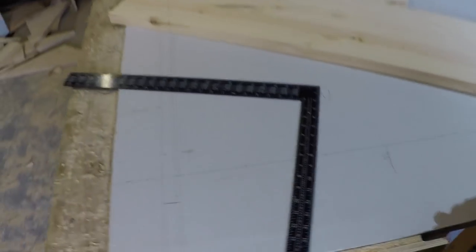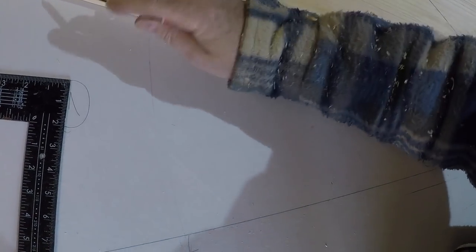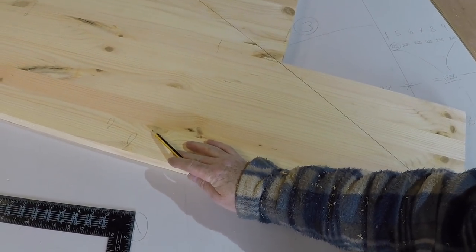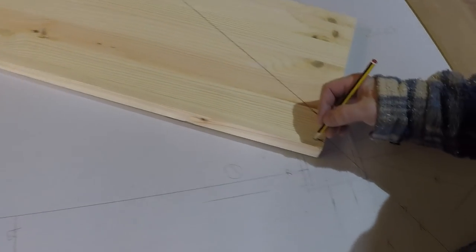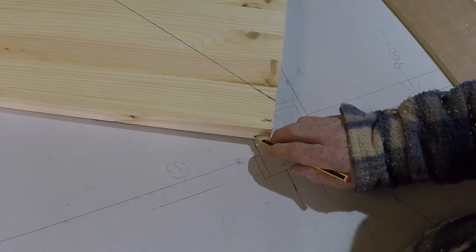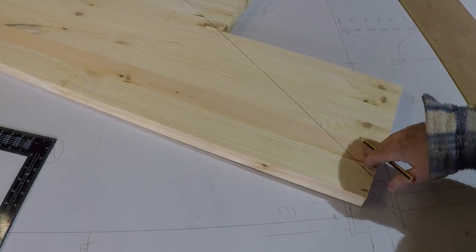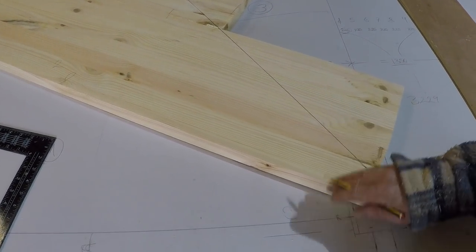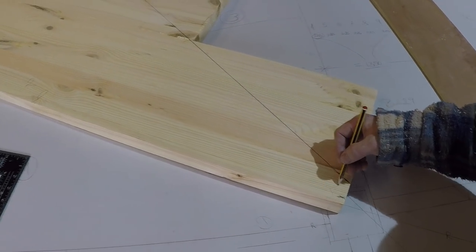There we go, there's our shape at number 2. That's the face mark, that's the nose, and I'll go and cut that out. Of course I've got to come round my newel, but if I cut the worst way first and then plane it to fit so it's nice and exact, then I can take out where my newel post goes. Right, let's crack on with that.